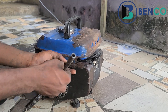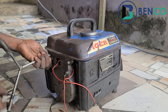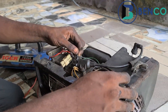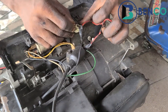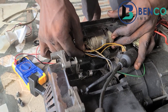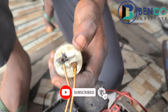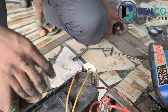What I can do now is open up the generator and see for myself. My next lookout should be on the capacitor, to see if the capacitor is in perfect condition. I can also scan the wires to see what the issue could be. Let me look at this capacitor — it looks like it may be bad.